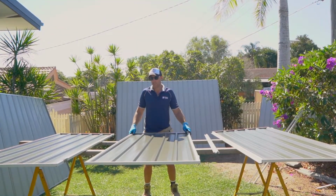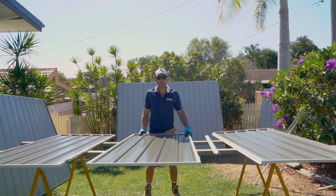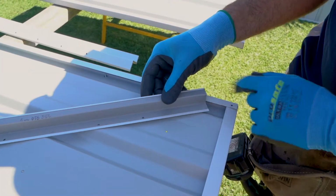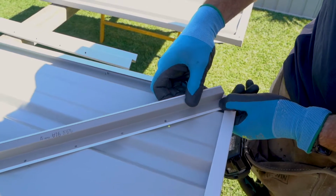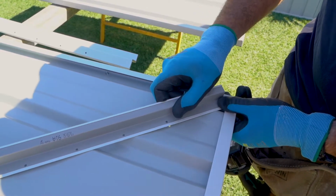Okay, now we've got all our channels on, what we need to do is flip all the doors over and put on our diagonal bracing on the back. Okay, what we need to do now is get our jamb in the corner of the door and then line up the pre-punched hole in the sheet with the pre-punched hole in the jamb, and we'll put a screw in that.